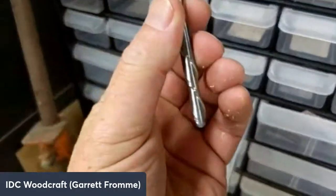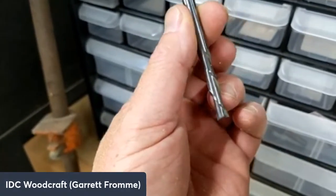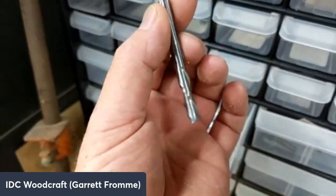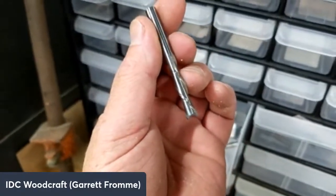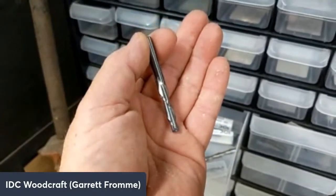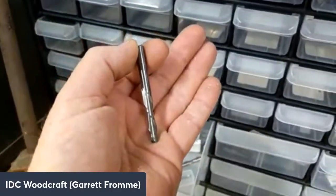All right. So this is a quarter inch down cut. Nice. It's got the straight bits all the way down, the spiral, and that's going to have a nice clean cut all the way down. But if you're hogging out material with this, you're not only wearing it down, you can't run it nearly as fast. That's the intention of a roughing bit, is to cut down that time. And so many people have already done that, and it really kills their time way down with a hog.